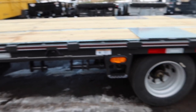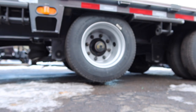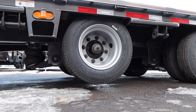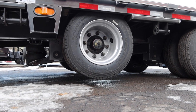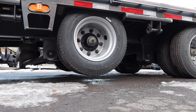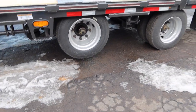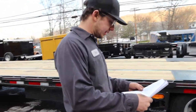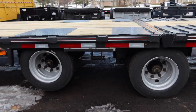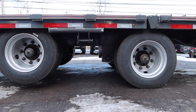You can see the tires going up there — comes right up off the ground and tucks under there. The air compressors kick on as it gets down to the lowest point. This is a 60 inch spread axle; you can go up to a 72 inch spread to distribute the load a little better.